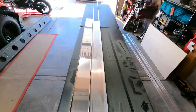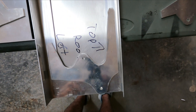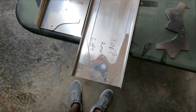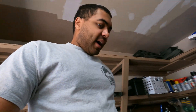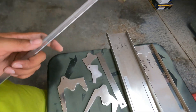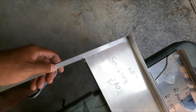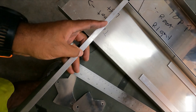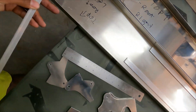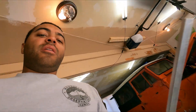Mocked up the cap strips to see how it would look — center point to center point looks pretty good. Let's center punch this and get to drilling. Before I start those drills, I'm actually going to make a center point tool. I took some measurements, I'm going to cut this to length and make it an almost perfect fit, then punch out the center point to use as a reference for the entire length of the rear spar.